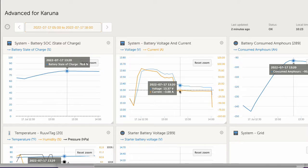I've already moved the negative to go directly to the battery for the external regulator. I'm going to test it tomorrow — I don't know if I'll run long enough for a good test, but that's my theory. The voltage drop across the negative cables is great enough that it's causing the external regulator to go into bulk, absorption, and float prematurely, almost as soon as the timers time out. Everyone knows the positive voltage sense should go as close to the battery as possible, but the negative is less obvious. Run both positive and negative voltage sense wires as close to the battery as you can. Positive should be fused. I think it's very important with lithium.